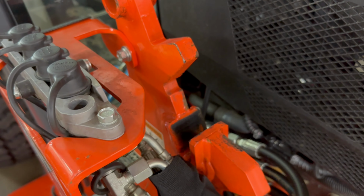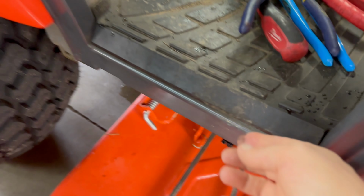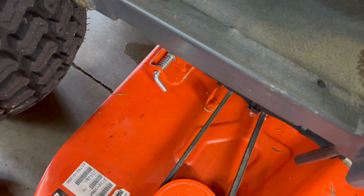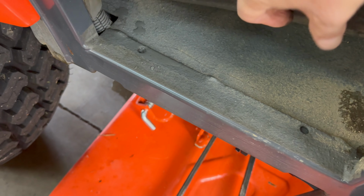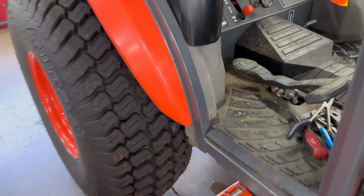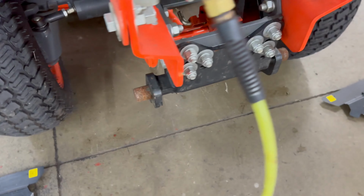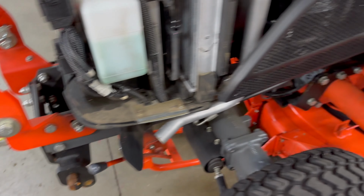We're gonna respray them. We're also going to pull up the sound deadening, well, the rubber mat, the sound deadening, and it's pretty clean, but we're gonna pull out all the sand and clean everything just to make sure we keep an eye on things. And just pretty much go through, and typical areas that pick up some rust, we're gonna clean that and apply lubrication to keep it protected.